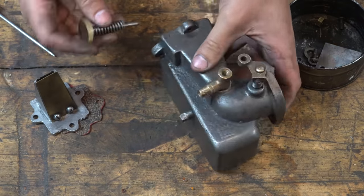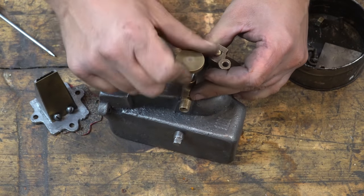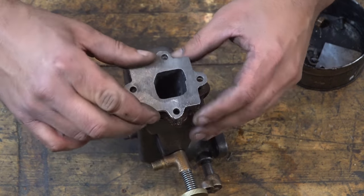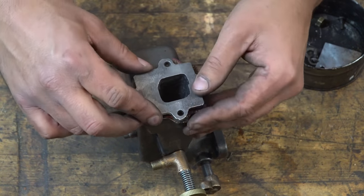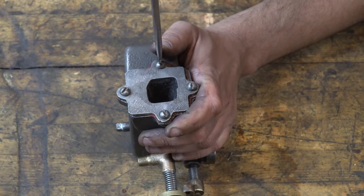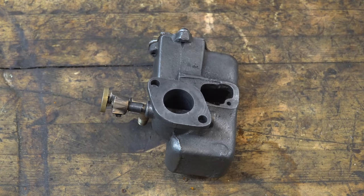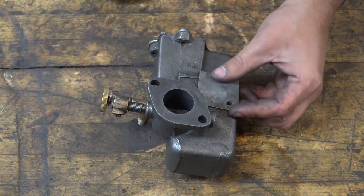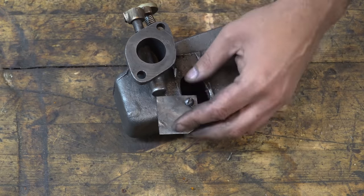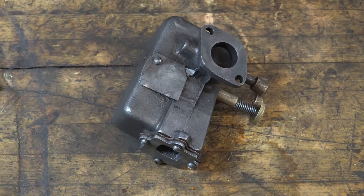Here we have the mixer slash carburetor as some people might call it, but this isn't really a carburetor in that sense. Everything has been completely cleaned. You can actually buy the valve stems or the needle valve stem portions completely brand new as well. So if these don't seat well — if when I close the needle valve a little bit of gas still gets through — I can buy a new needle valve. Little things like that in terms of having those options is really nice. Rarely do I get to have that with the tools I'm restoring, and it puts my mind at ease especially with this one.